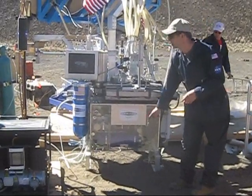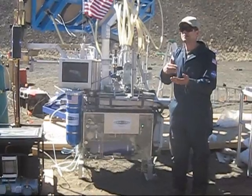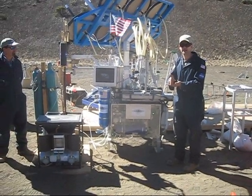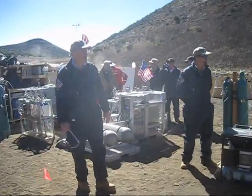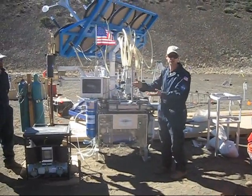We also get water vapor, which we condense and collect in a reservoir. When we collect enough liquid water, we periodically transfer it over to the electrolysis unit. The electrolysis unit splits the water into hydrogen and oxygen. Oxygen is our product out of the system, and the hydrogen gets used back in the methanation reactor step. So it's really a closed loop system — the only thing we put in is dirt and energy, and we get oxygen out.